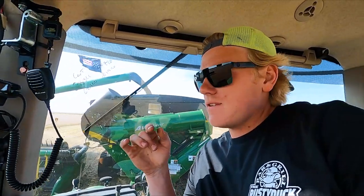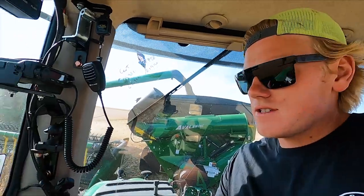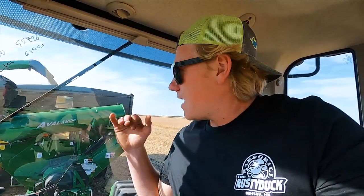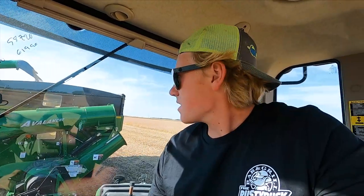Chet's unloading — first load of the day. Same as the 2596, it tells me if I'm loading too heavy on the hitch or too light, too far back on the cart. That's displayed on the Sioux Harvest as well. That hitch weight, I'm at about 40% — really shouldn't get any more than that, otherwise you're putting too much weight on the front of the cart. With these big carts, they suggested loading the first load about the center, then one on the front and one on the rear. You can watch this Sioux Harvest display, watch your hitch weight and move around when you want. I don't like loading it too heavy on the front so that I block my windows.